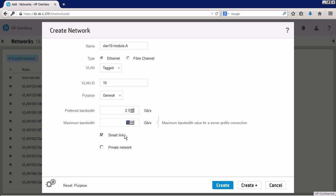Okay, Smart Link, leave it the default. It's just more like a link state tracking for the Cisco networking folks. So pretty much we'll monitor the uplink, physical link status. If that link or the whole port channel goes down, we'll disable the server NIC. Then on the VMware side, on the server side of Windows Linux, they have the ability to fail over to the redundant NIC.